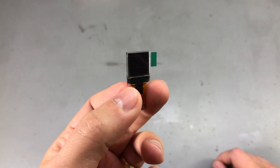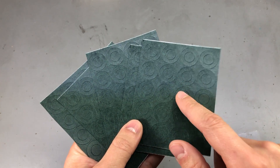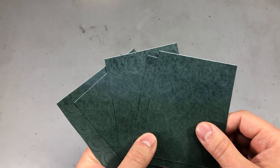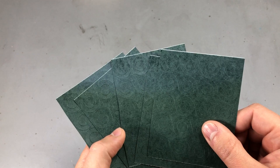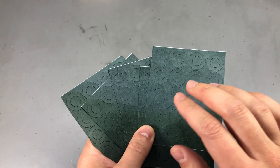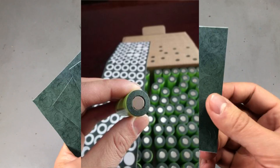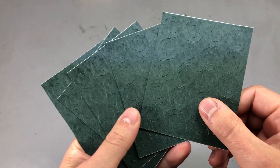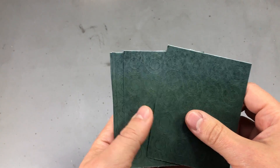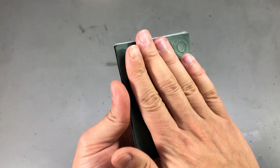So personally I think I'm going to stick to one-off quantities for these displays. Next up I have some battery insulating gaskets sized specifically for 18650 cells. If you ever open a pack of those or build one yourself, you've seen the nickel strips which get spot-welded to the end of the cells. Those nickel strips, especially on the positive side, run right across the negative shell of the battery and the only separation is the thin PVC insulation wrapping the cell. A good solution is to add one of these paper insulating gaskets between the nickel strip and the body of the cell at the positive side. This green-colored paper is commonly used for insulation and ideally is fire retardant, so in case something gets very hot it doesn't catch fire. You can also get this type of paper in large rolls that you can cut to size, so after finishing a pack you could seal the entire connection side with a bigger patch of this paper.